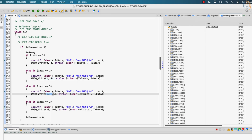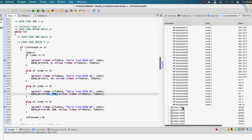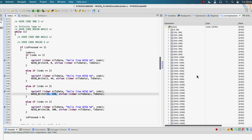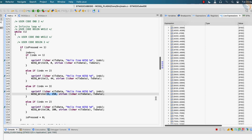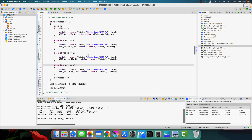Now we will see if the data is able to cross the sector boundary. Page 15, offset 250 is at the offset of 4090 from the beginning. There are only 6 bytes remaining to be written in this sector, and our data size is more than that. Here you can see the data crossed the boundary successfully, and we have continuous data. This time we updated sector 0 and sector 1, and we still have the previous data in sector 0. We were able to write two sectors continuously, and the sectors got updated instead of clean writing.